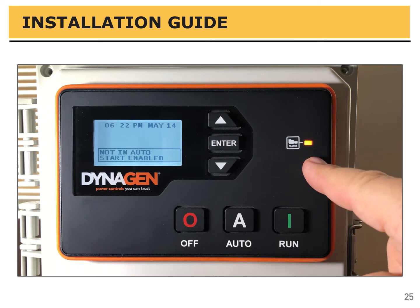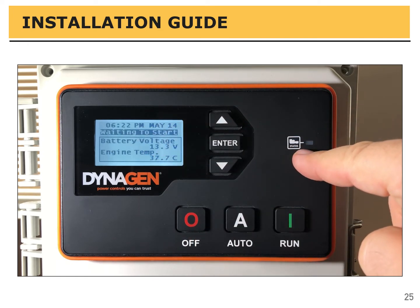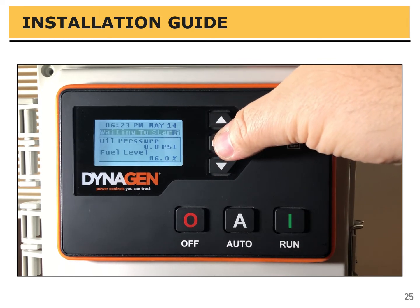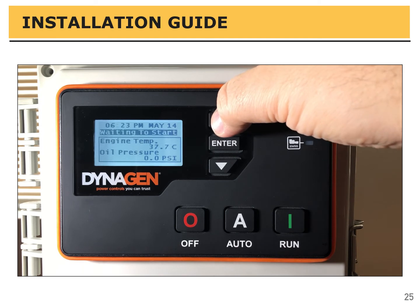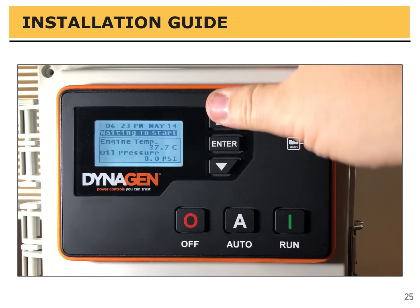This is something we see often. People see an amber light and they think there's a warning. It is a warning. It's a warning telling you that you're not in automatic mode. You're in manual mode. Most people use their generators in automatic mode. This is just to let you know, hey, you forgot to put it in auto and the start is enabled. You can't press start to start it. All you got to do is press the auto button. This message goes away and your warning light gets turned off as well.